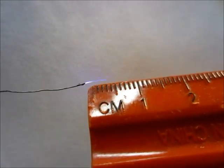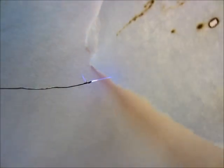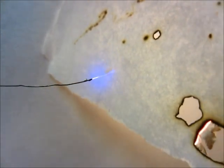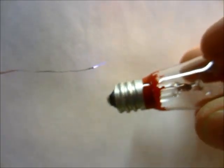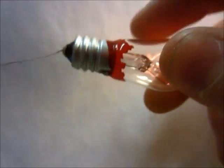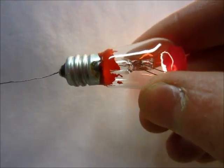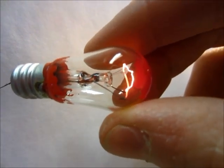Here's a nice close-up shot of the plasma from my Tesla coil with the top load removed. As you can see, it's about 0.5 centimeters — 5 millimeters. It will actually burn paper; if you just get it close so the stream of plasma is hitting, it'll start browning the paper. We've got some smoke there! Another cool thing is, if you take a light bulb and hold it so the base isn't grounded and touch that part to it, it lights up a little bit — probably because the energy is radiating off the filament.